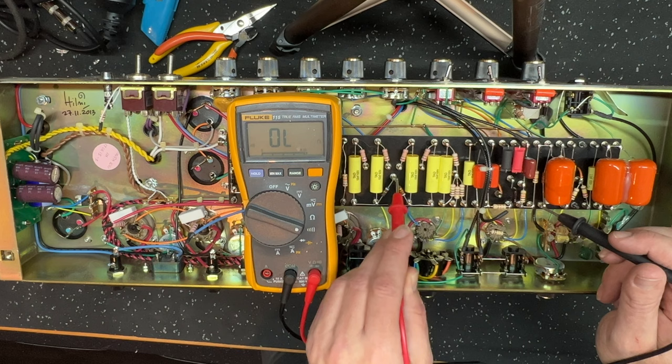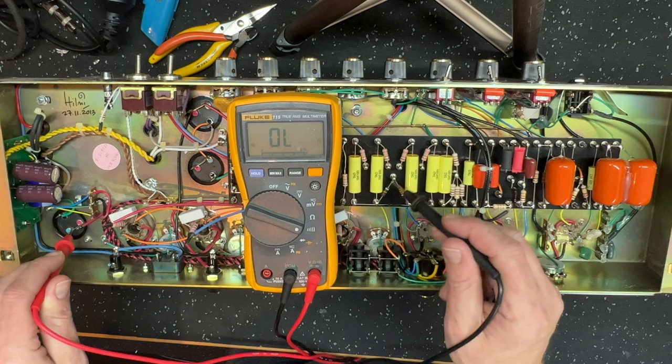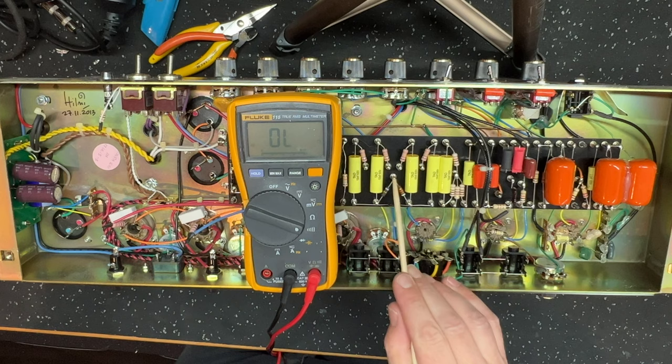And this guy is coupled. If I go all the way over here, this is a 2x50 microfarad can cap, bridged together, 100 microfarad filter on the phase inverter. There it is. Okay, happy days. It's also connected to here though. What I'm saying is that there's no dropping resistor from here to here.